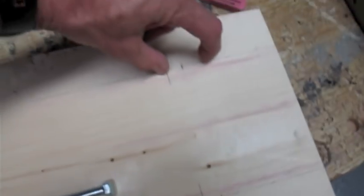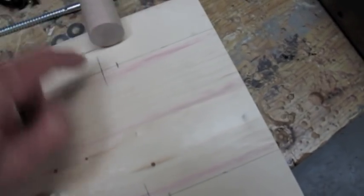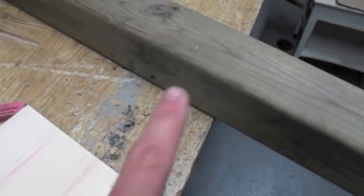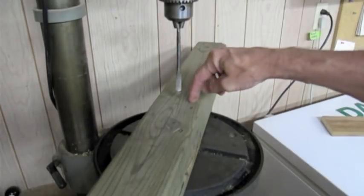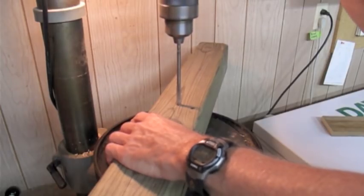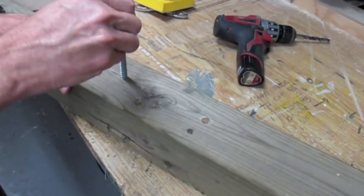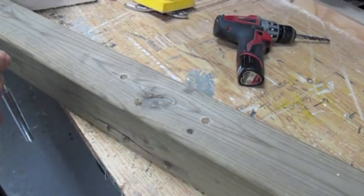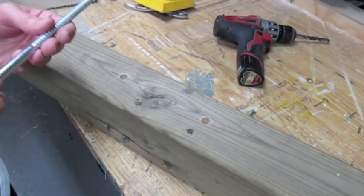We want our dowel to be right in this area here. It's an inch and a quarter dowel, so halfway I measured down 5/8 of an inch from the tip in, and we should be able to drill our holes here and here. We also have to drill out the post. We're going to use a 3/8-inch drill and drill through the post so that we can slide our 3/8-inch lag bolts right through without threading into the post. Once you have these holes drilled, take your lag bolt and slide it in — make sure it's a nice easy fit. When you go to assemble the bed, you want the bolt to slide right through and partially go into the bed rail, then use a ratchet to put the rest together.